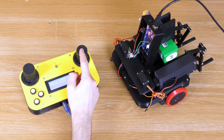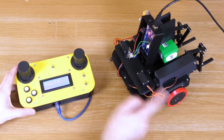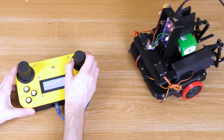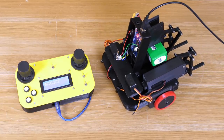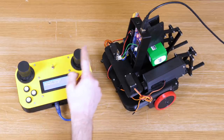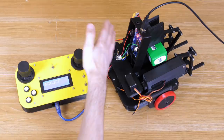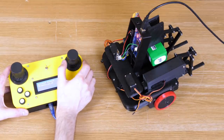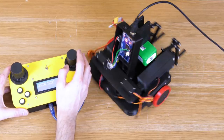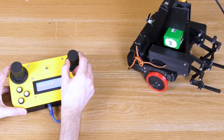I'm using the right-hand stick to control the robot base. The value from the stick is mapped to both wheels, so pushing the stick forward makes the robot go forward and pulling it back makes it go backwards. I've taken the middle position from that stick as a plus-or-minus swing around zero, adding that value to one wheel and subtracting it from the other, so moving the stick sideways causes one wheel to turn one way and the other the opposite, mixing dynamically so you can steer while driving forward.